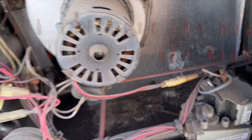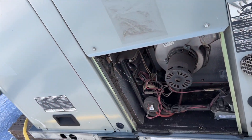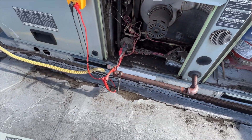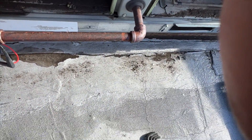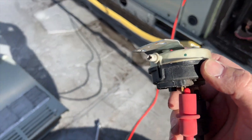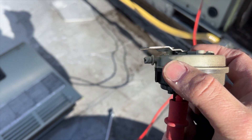Make sure the pressure switch is all hooked up, no holes. I'm gonna go ahead and kill the power to reset that error code, then check the pressure switch. We're checking to make sure it's actually open because it should be normally open. We're gonna clear out the tube. Here's the pressure switch — that end is a little jaggedy there, but we'll test it.